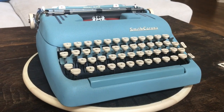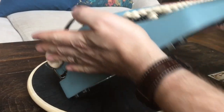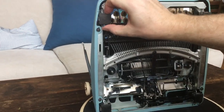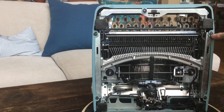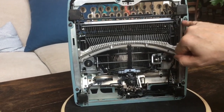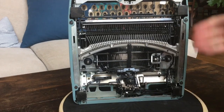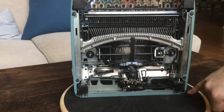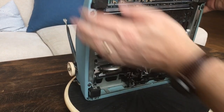My executive assistant will now show you the bottom of the machine and the case. We'll tip it up on its back very carefully. You can see the nice clean underside — it's got the original block rubber feet, which are still nice and squishy. I put little rubber grommets: one in between the screw and the body, and one between the body and the frame. Because when it came out of the factory it had a rubber grommet on both sides of the body, which helped with noise dampening and vibration. So everywhere it mounts to the frame I went ahead and did those to help reduce noise and vibration, and it is a nice quiet typer.